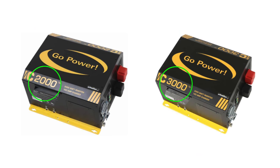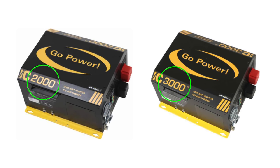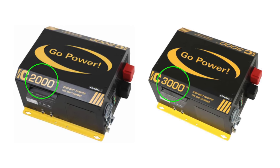What you can actually run on the AC side via your inverter depends on two things: the capacity of that inverter, how many watts it can provide, and that determines what it can power. That's pretty straightforward. The other thing is how it's wired. If your inverter came with your RV, there's a good chance that your AC systems aren't hooked up to it, and maybe not even all of your outlets. So how it's wired into your system makes a big difference.